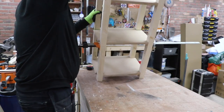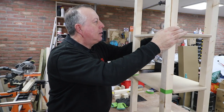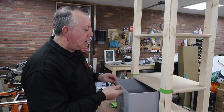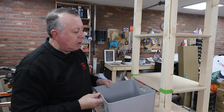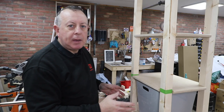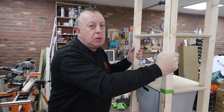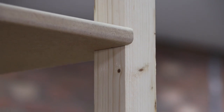So that's the first dry assembly and I'm really pleased with that - it's gone together nicely, all the notches are fairly tight so once you put them all together it doesn't really want to go anywhere, and it's looking like I hoped. The bin fits, which is a bit of luck. The only thing is that there's opportunity for the bin to go wherever it wants, so what I'm going to do is put a couple of hanging rails in here and a stop at the back so it's centred and looking straight. Now I was thinking about putting dowels on the connection between the uprights and the shelves, but it's so tight - I think once I've glued the thing up whether it's got a dowel in there or not it won't make any difference. There's plenty of MDF timber connection there with a bit of glue on it.